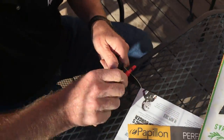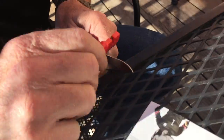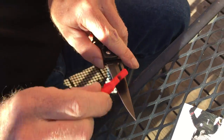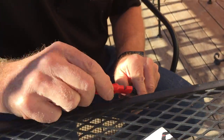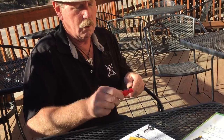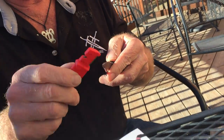Turn here where I can go to work. Just like this — match the bevel on the blade, turn it about 30, 40, 45 degrees, whatever you can get out of it, just like that. Come right on out to the tip. It's a little bit of a thick grind on the blade. Just like this, right on out. Just don't press too hard because it will cut that blade — there's no question there.